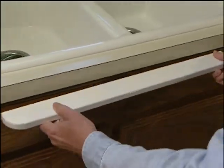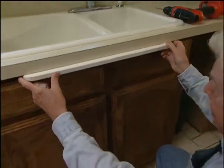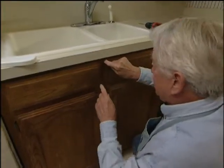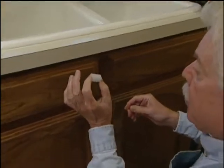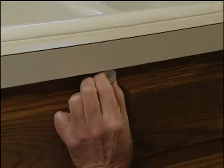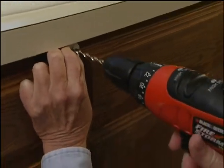Here's the bar that you lean against — it fits right here underneath the bottom of the countertop. In order to get the pin in through here so that it can meet up with the triggering mechanism, we're going to have to drill a hole. To help you do that, they provide this little bushing. You put it flush up against the bottom of the countertop, push your drill through there, and that's going to give you a nice straight hole.